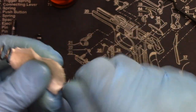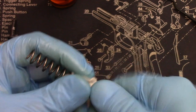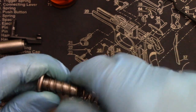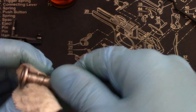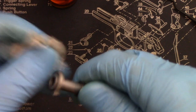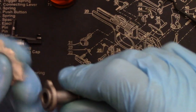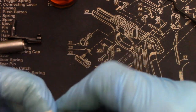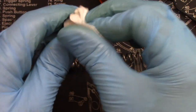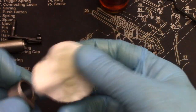For the spring, go ahead and turn it around a little bit and get in there. This part does come off, so if you want to get in here you can. It's just like cleaning a guide rod on modern firearms — you want to spot-check it; it doesn't have to be shiny clean. Get the spring back on there, take a fresh cloth with a little streak of oil, and hit all of them again. You can see it's fairly clean. Put them to the side and on to the next step.